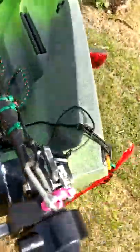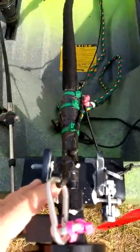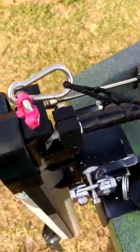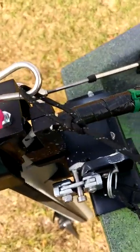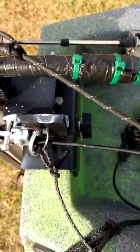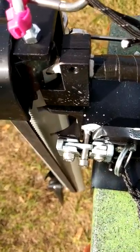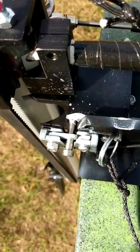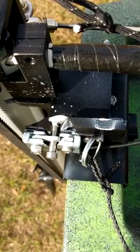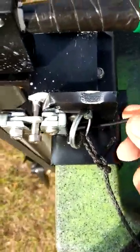Now the cable comes straight back at almost a perfect angle to the top of the head. To raise and lower the drive, there's a rope system here — when you pull on the rope, this latch mechanism right here, when you tug it a little bit, that lever moves and unlocks it. That's actually a lock so that you can move the drive up and out of the latch.